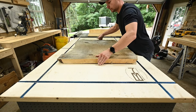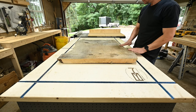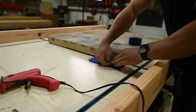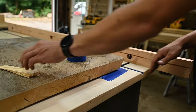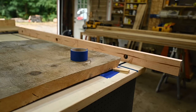For using the jig, you have to get the wobble out of the slab you're surfacing as well as secure it to the table. To do this, I use shims and hot glue. I shim in each opposing corner of the wobble, being sure to split the difference in between. I also use painter's tape on my bench, which makes cleaning up the hot glue when you're done a breeze.